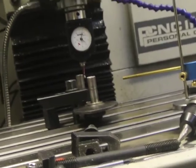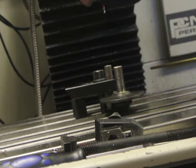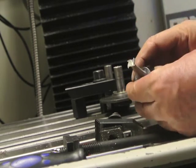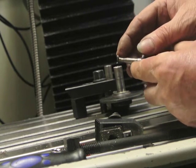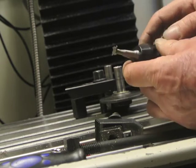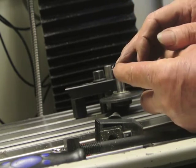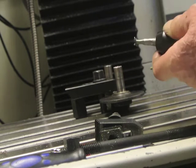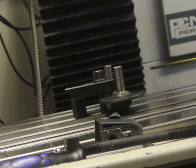We'll go back to here, take this up in the Z plane, take this out. And here we have the cutter. Basically this is homemade as you can see — pretty rough, but it works well enough. It's a little bit on the blunt side to be honest. However it's basically just an old end mill that was broken on the tip. Before I got my special grinder that does the tips, I used to think of things to do with them, and one was to make little slot mills. If you grind the end flush and get it nice and flat, and then grind the stem away, it's quite good. I've got one or two that were done in the tool and cutter grinder that look much nicer than this. This one was probably an early experimental one. But it's the narrow one, and that's the one I want.